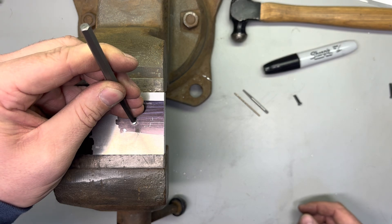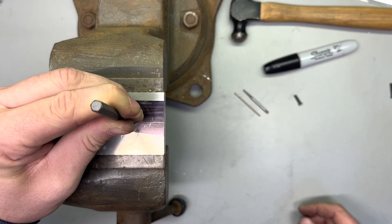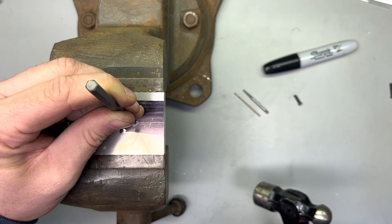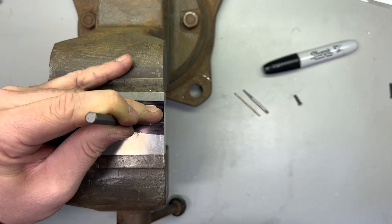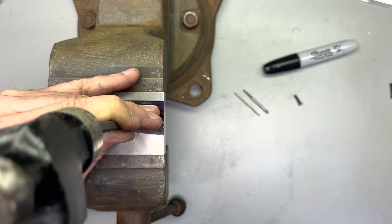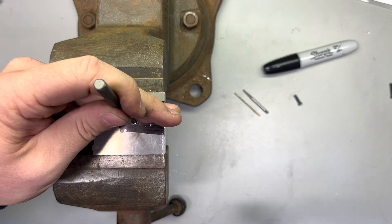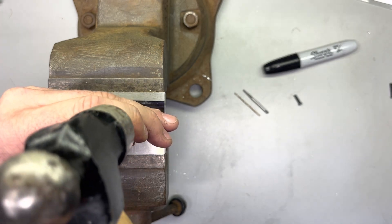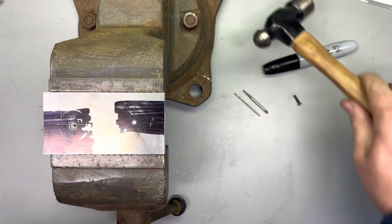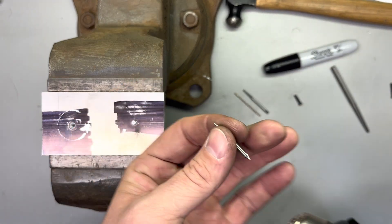This really matters — you've got to be in the center. If you start your hole off-center on this screw and start drilling, you can get into the work piece real quick and tear up your threads. The whole point of this is to try and save the threads on the part. And again, I'm going to use my centering bit — these are handy.